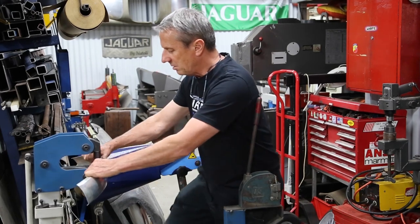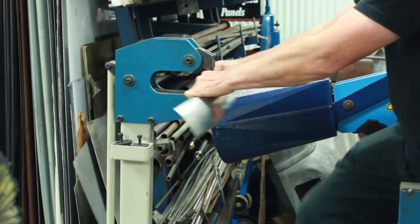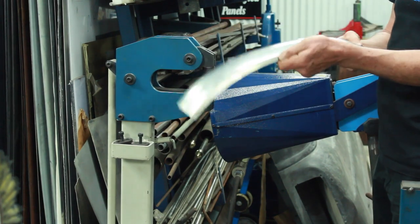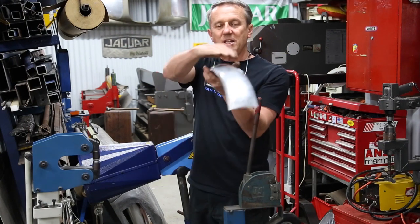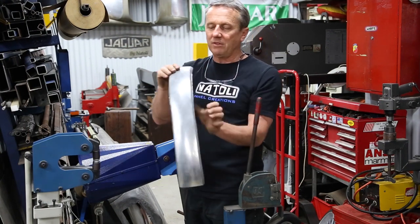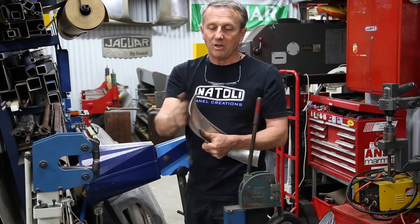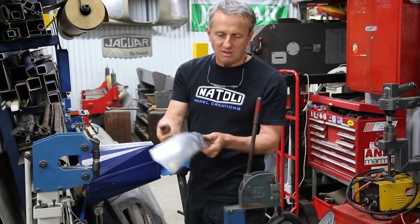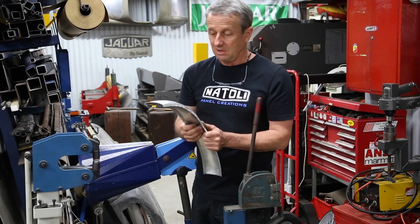This is just a little piece of aluminium. So that becomes a bit of a little trailer mudguard or something similar. As you change the shape and straighten it out, you end up getting more shape in it. So they all do different things. If I was to pull this around more and more, you'd find that the compound curve would flatten itself out quite some. Just little tips and tricks on shrinking and stretching. Hope you liked it. Thanks.